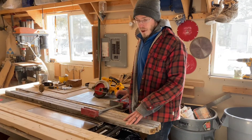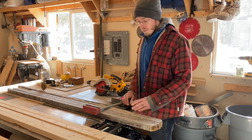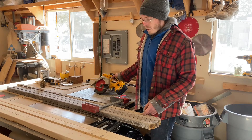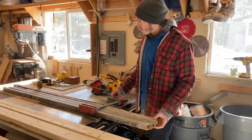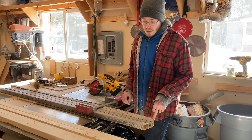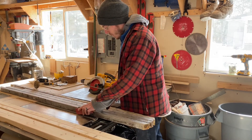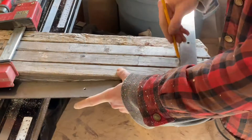So what we're going to do now is I've got my four long pieces — I need my four short pieces, each at 39 inches. I'm going to clamp them together and cross cut them with the skill saw, then measure the length I need and cross cut the other length. I'm cross cutting them twice just because these are repurposed and they each have an angled cut on one end and we want square ends. The clamp is just to make things a little bit easier and hold it all together instead of everything flopping around on me.